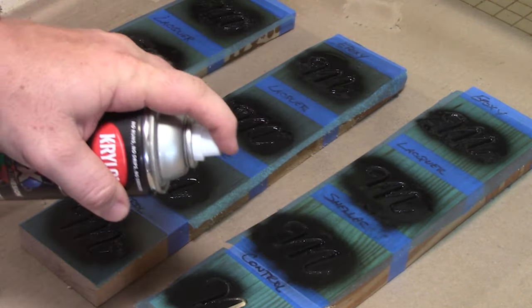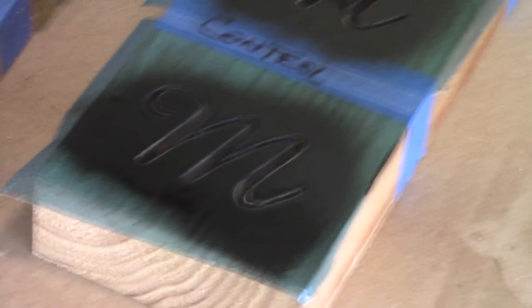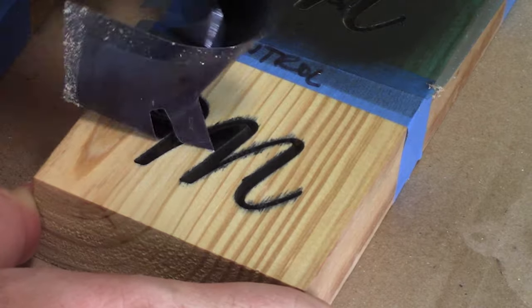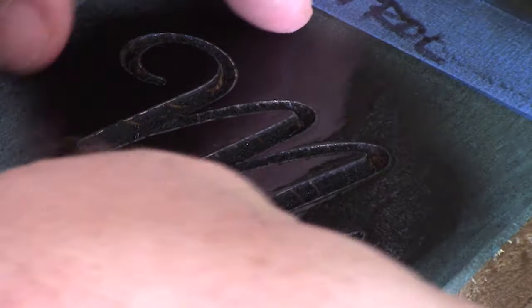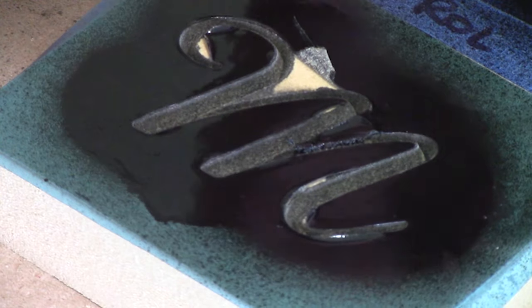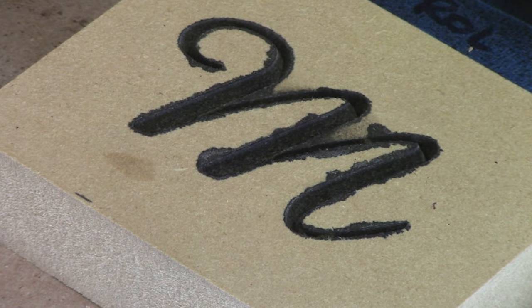Once it's painted, we simply let it dry. Then let's start peeling. I start off with the pine, and as we can see with the control group, there's definitely quite a bit of bleeding in there — that's to be expected. Now let's move on to the white oak. You see a little bit of bleeding, but it's just on top, and hopefully we can sand that off. And then the MDF — as we figured, with no type of seal there at all, there's quite a bit of bleed. MDF is basically just compressed sawdust, so we thought we would see that.